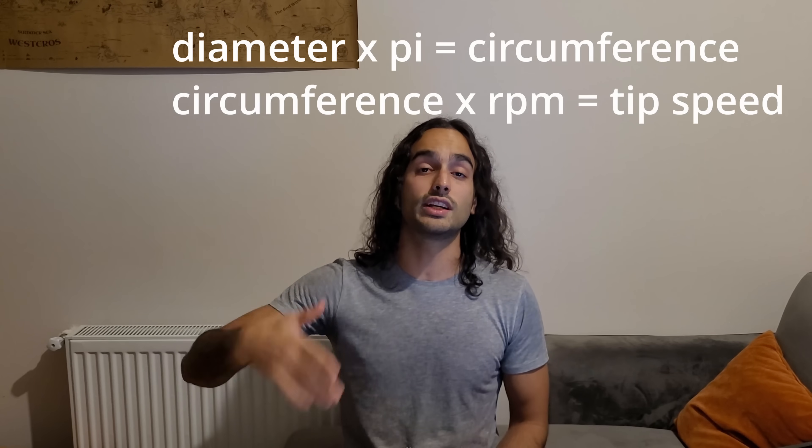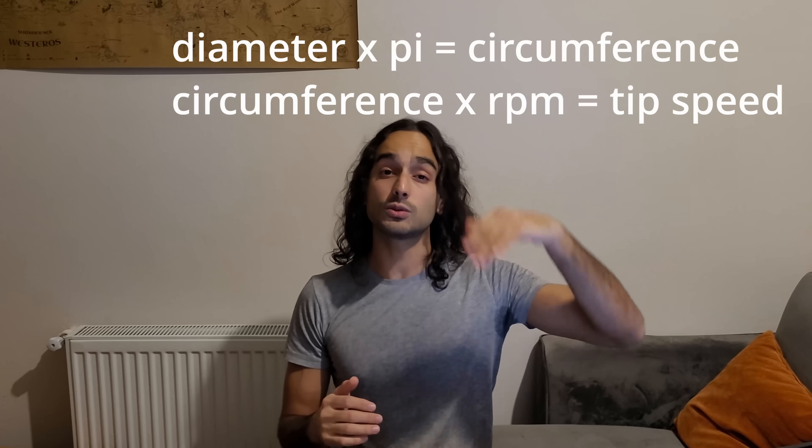In cases like this you have to set some variables even though they might not be optimal, otherwise it becomes too complicated to untangle. So I will determine the diameter of the gears — if the diameter is set, we can calculate the RPMs necessary to reach speed of sound. With the necessary output RPMs we can divide by the input RPMs of 200 to find the gear ratio we need. I will assume we can fit enough gears to get the ratio with 15 centimeters.